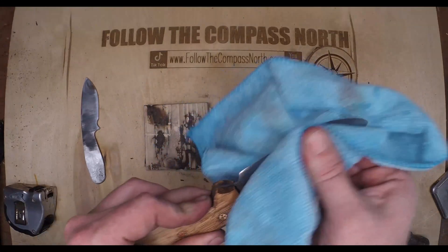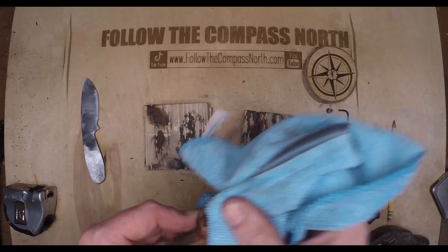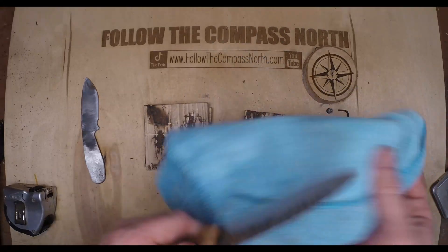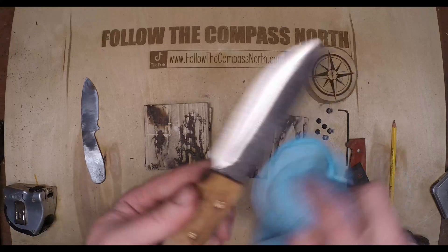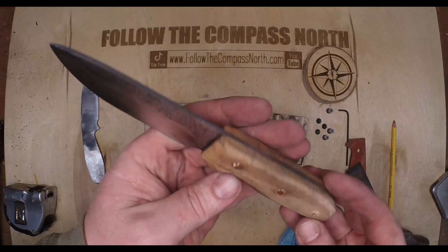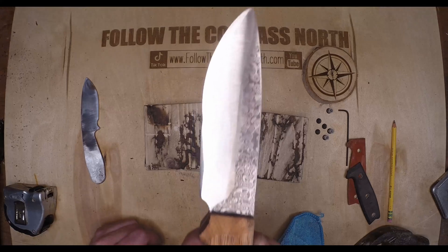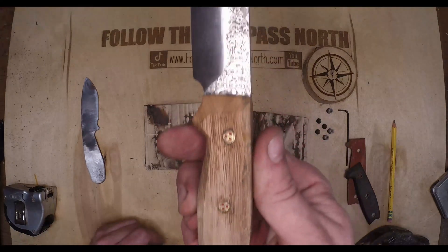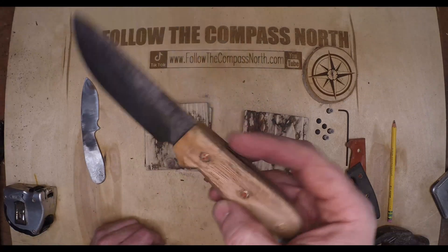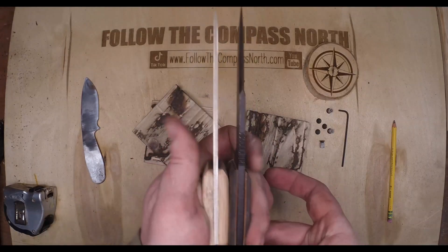30 minutes on the grinder later I have the blade belly and bevel set, which of course takes off the Damascus appearance. Even though this is still Damascus steel, the acid etch is no longer showing the differences between the 15N20 and the 1095 steel that this is made of. The way modern pattern Damascus or pattern welded steel works is that you're exposing the layers between the two pieces of metal using a little bit of ferric chloride acid. The 15N20 steel resists the etch while the 1095 gets eaten away a little bit, showing you the pattern that already exists but is not visible to the naked eye.